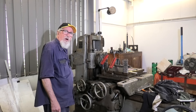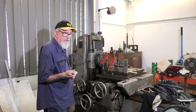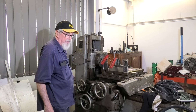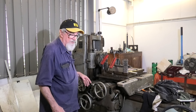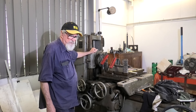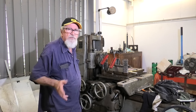It's a very old electrical control cabinet — we'll zoom in later on. You have to start the machine with the feed already turned on; it's not supposed to be selected while the machine's running. You can select the coolant pump on or off. You've got forward and reverse on the motor panel and a three-speed motor — a big electric pancake motor down under the belly of it. Up here you've got high and low ratio, and the maximum is 540 and the minimum is 45 RPM. So it's a reasonable speed range.